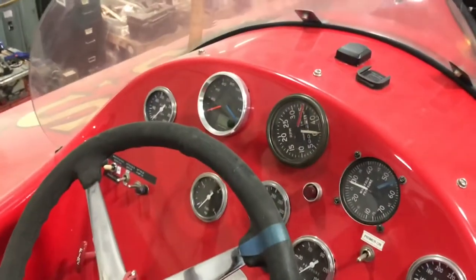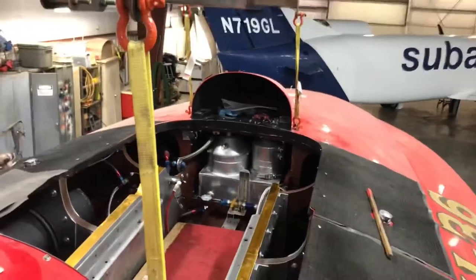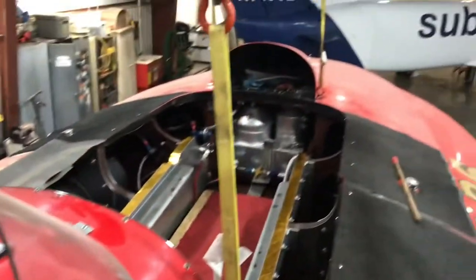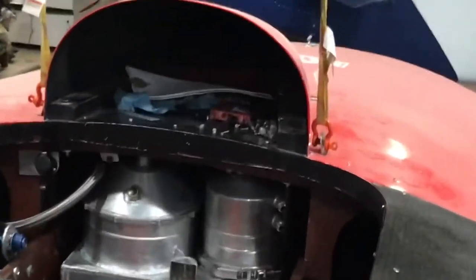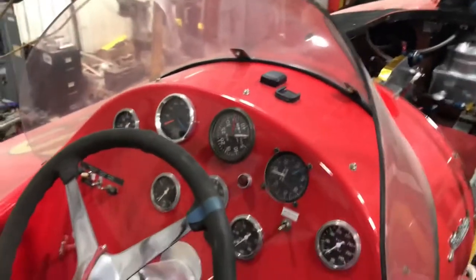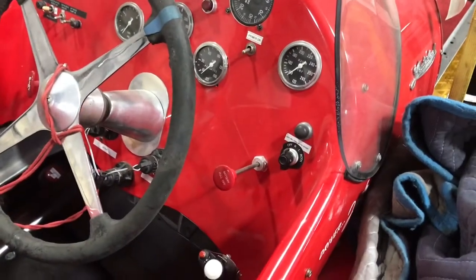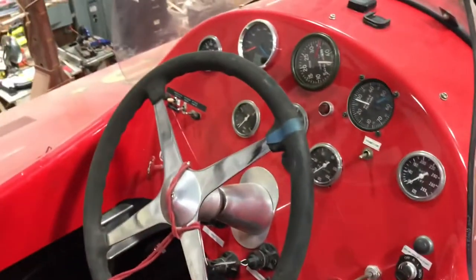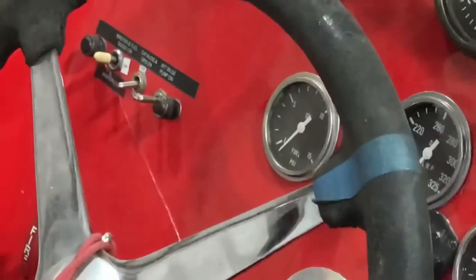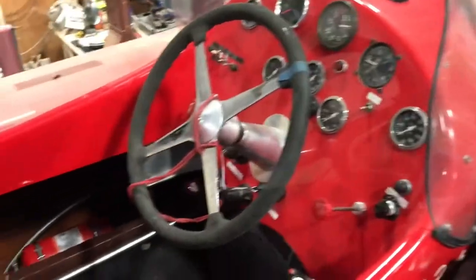She has a GPS recording speedometer and also has a race pack mounted up there in the front for all of our engine parameters — that's how we're calculating the speeds. The GPS antenna for the speedo is right there. Other than that it's a pretty basic system: bilge pumps, the starting circuit, no generator circuit which is nice, fuel boost pump, and a few other real basic systems.